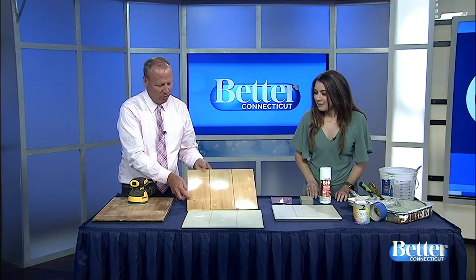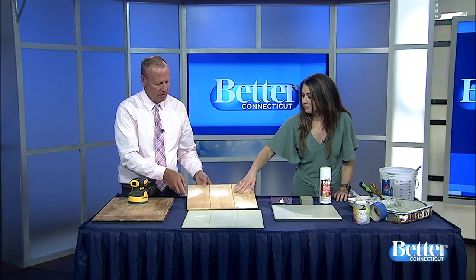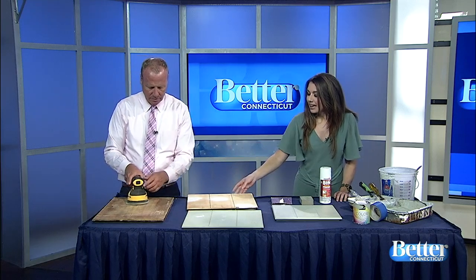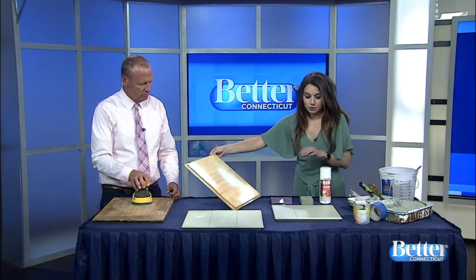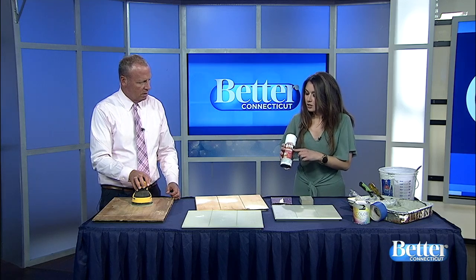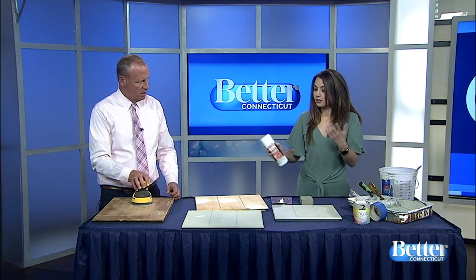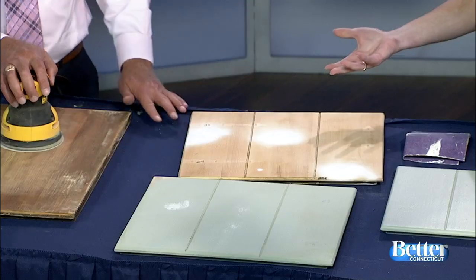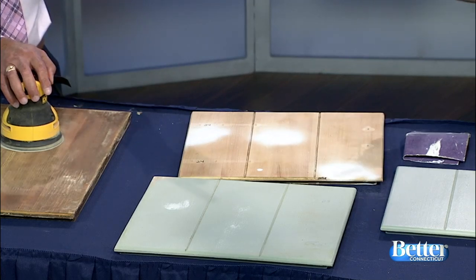This one's 24-24. And here's the sanded version — you were working on that with the sander. And then there are knots in the wood, so I used this knot primer. All you do is go outside in low wind — you don't want it blown back in your face — and just spray the knots so that they don't bleed through the paint.